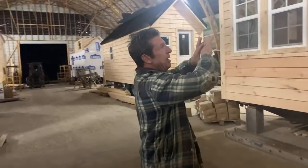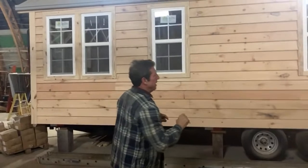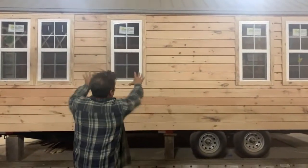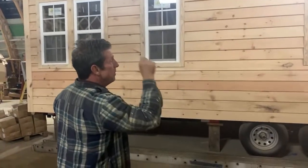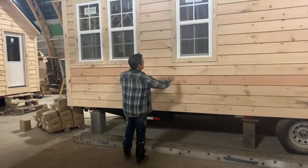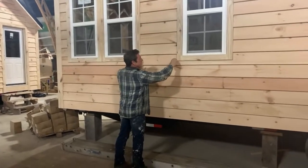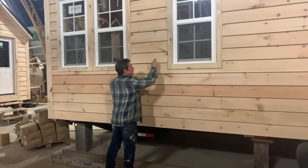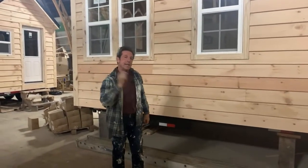What I would do, if I wanted these windows exactly where Judith wanted them, is take graph paper and make a picture of this wall right there. I would draw where I want my windows. And if I want them particular, because I have an armoire that's 22 and a quarter inches to fit between these two windows, I would make sure I've got a square that equals a foot, one square and two squares in between there. And I write on there, I need 22 and a quarter inches between those windows. Done. I don't have to talk to you about it. You give me the information, we draw it.